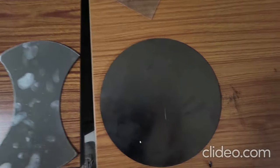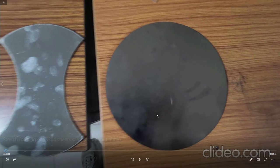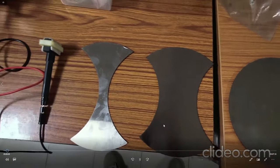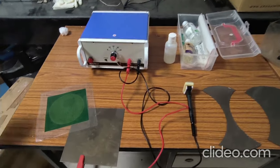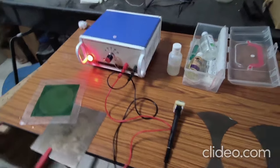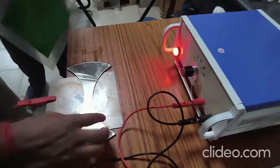The next video shows stretch forming of sheets. In stretch forming the main aim is to deform the sheet through a punch-die-blank holder setup, such that at the end of the experiment you can construct a forming limit curve — that is the whole idea. We are not going to do deep drawing; rather it is a stretching operation where the sheet is not going to draw in.